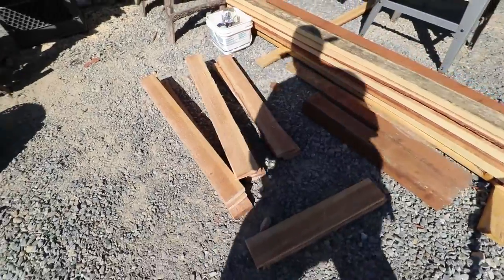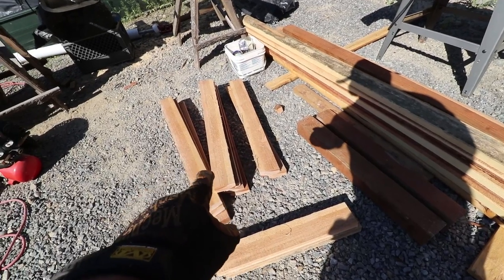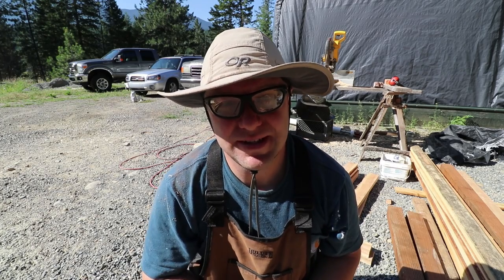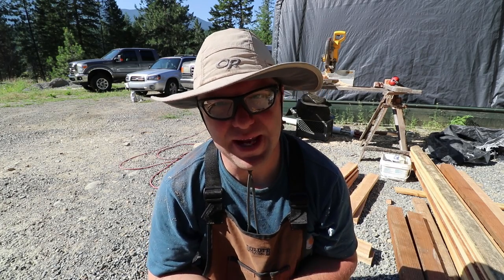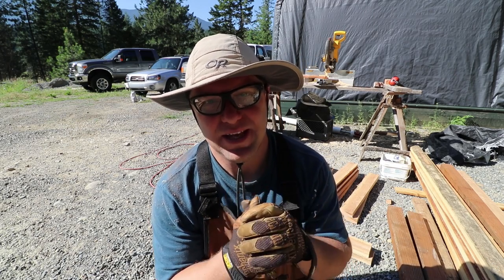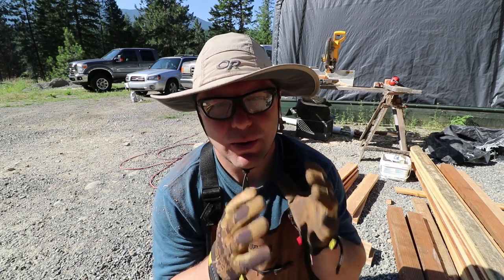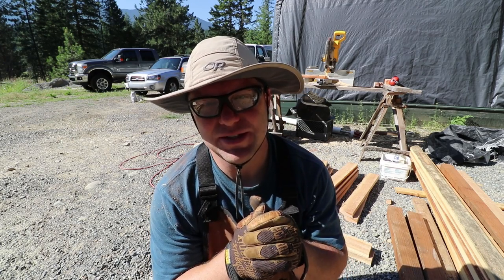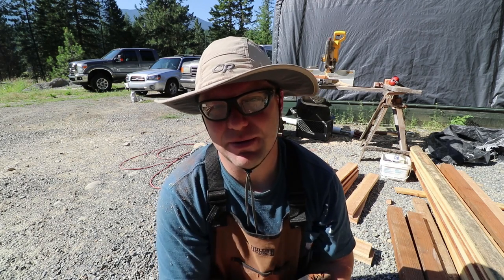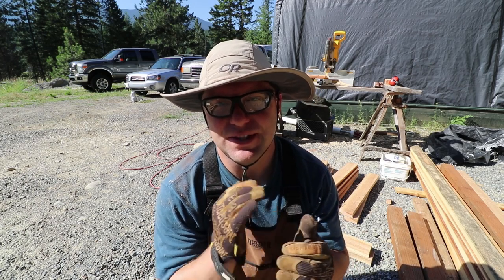This set of sawhorse plans calls for two 21-inch pieces, two 33s, four 34s, and three 36s. Most of this sawhorse is built to be lightweight — sawhorses need to be transportable so you can move them around. If you build something too big, it's too heavy and useless. We're building this out of two-by-four material and we're going to nail everything except for the top plate. We'll screw the top plate on because it usually gets cut up with use and we want to be able to replace it. So we'll nail the legs and all the cross bracing, then screw the top of the I-beam on.